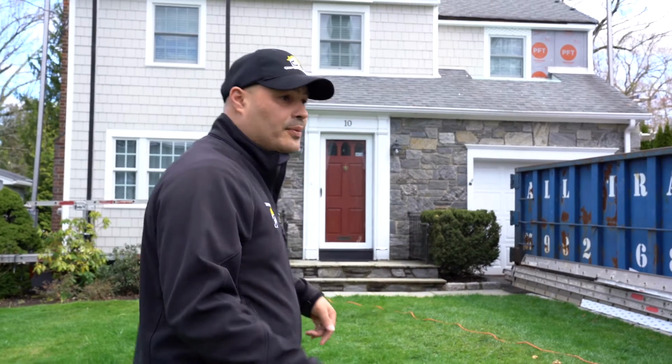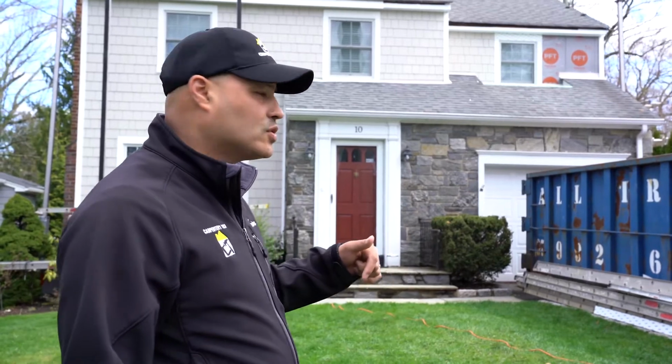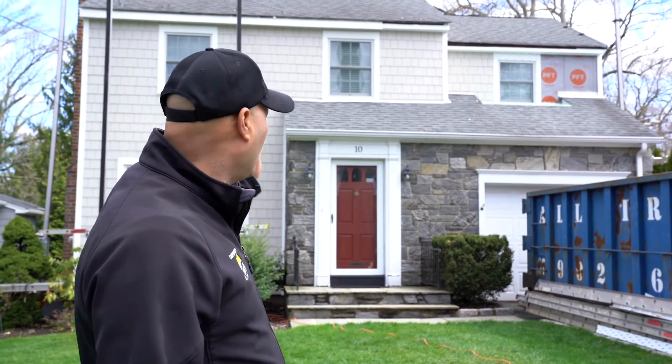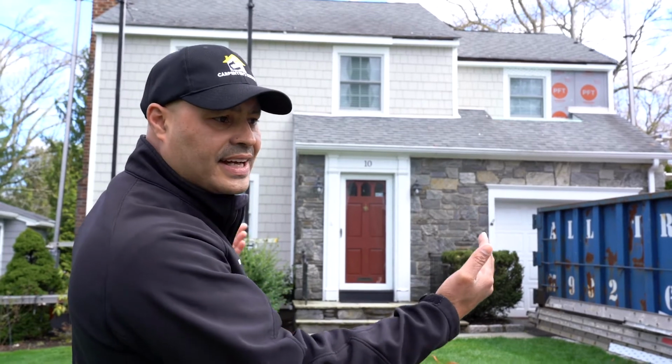So at this job, we spoke to the client here roughly about a year ago, and they decided to move forward now in 2021. They went with cobblestone James Hardie siding. They did 7-inch exposure on the shakes, and then regular lap siding on all three sides. But they also said, I want 1/2-inch insulation. So let me show you on the other side.